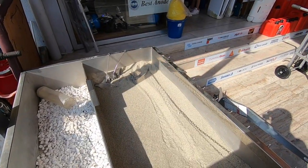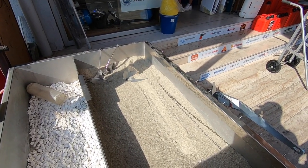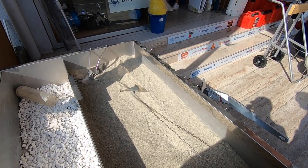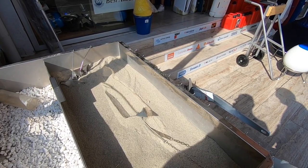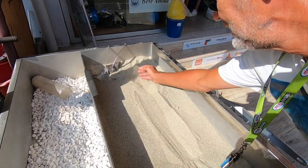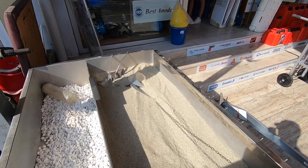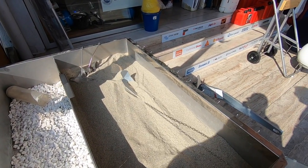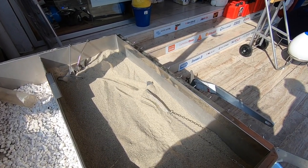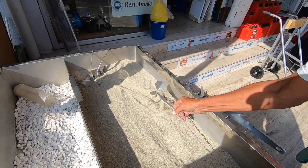Gone over on its side. And you're now pulling your boat backwards, pulling the chain backwards. And that's why it's called a plough. So we'll give it the benefit of the doubt and turn it almost the right way up. And watch what happens. It is starting to dig, but look how long that is: 2, 3, 3.5 times the anchor's own width.